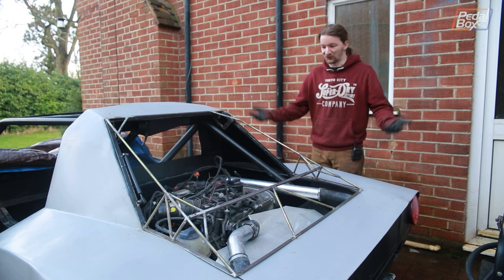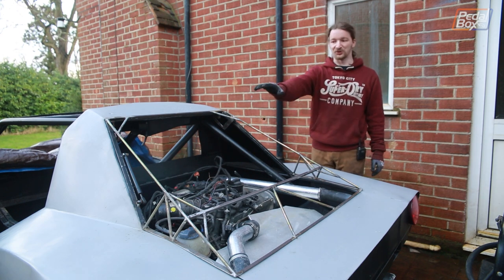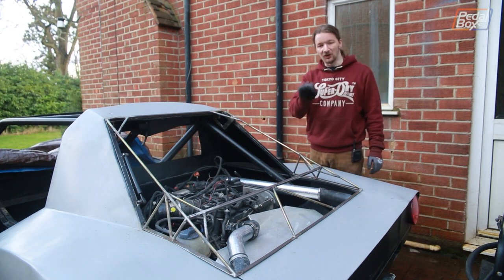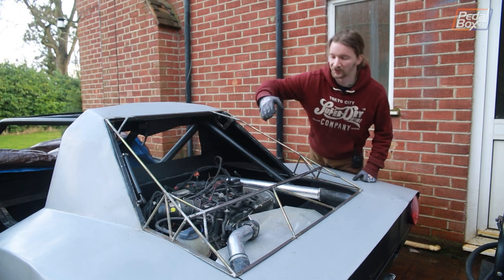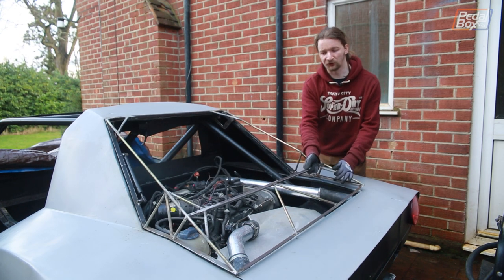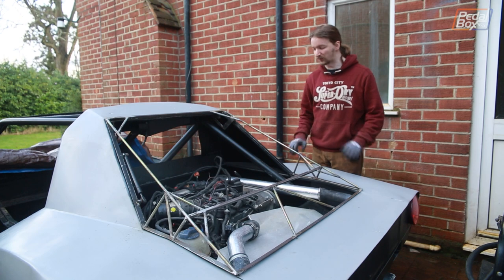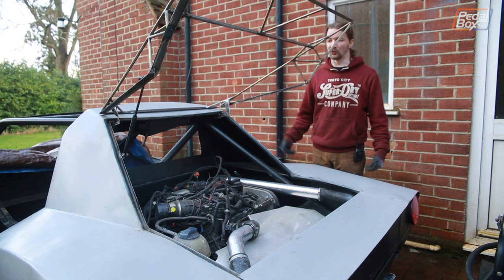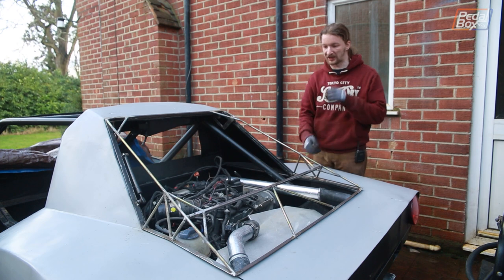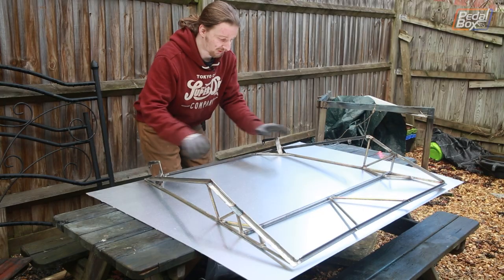It's perfect — works first time, every time. It's genuinely amazing. Aid and I are both absolutely delighted. We've put it all in, welded it all up, and somehow it just does exactly what we need it to. The only minor issue is because the gas ram is running a little outboard of the car, it does push slightly to the side when closing, so you have to tweak it toward the driver's side a little bit. When we put the second one in on the other side it'll be absolutely immaculate. It stops at the right height and yields somewhere near the bottom so it's not always acting against the latch.